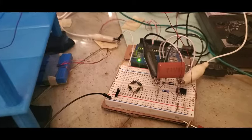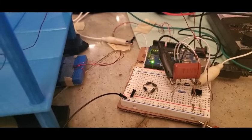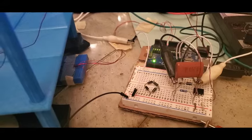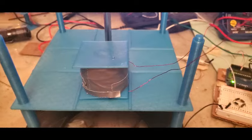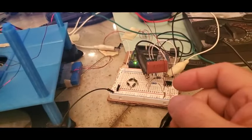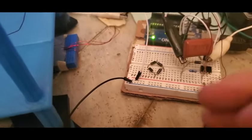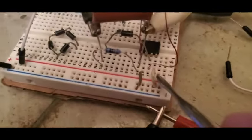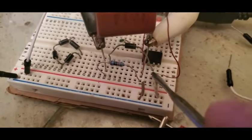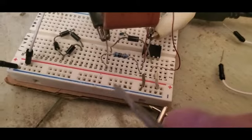And now it's stopped. But I was starting to build the bipolar commutation circuit, and I thought of one thing. I thought, well, it's worth looking at. I didn't think it would make a big deal, but I thought maybe it'll help a little. It turned out it didn't help at all, but it's still just worth mentioning. So how the heck is this thing getting back to source? And before, I was only using one switch, so let me get a pointer for you. So you have your positive bus line. It comes to here, and this goes into there, and then there's a switch to there, and that's where one end of the wire was going, and then I was just feeding it back to negative.